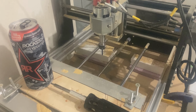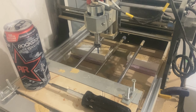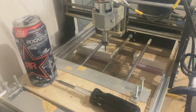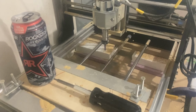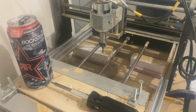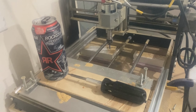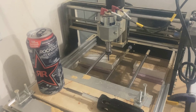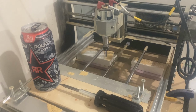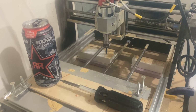So the very first step in making the basket is going to be to make a basket negative, as I'm calling it. This isn't the traditional way to make a basket. Normally baskets would be cast aluminum, but I am making this one in a different way. I will be making a negative, which will essentially be a frame upon which to place all of the basket parts while I weld them together, so it holds them all the correct spacing apart and aligns everything that needs to be aligned, etc.